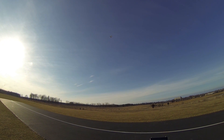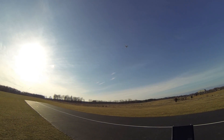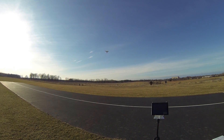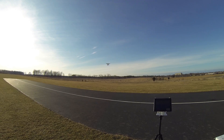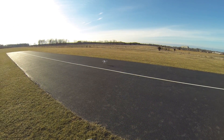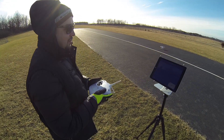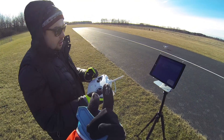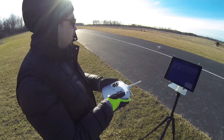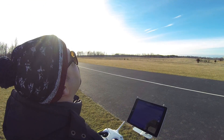I think it's supposed to come down a bit faster — if your battery is dying, that descent speed is a concern. At 30% battery you still have time to make a move. If you roll the throttle stick all the way down, that shuts off the motors — so be careful. I took over the control of the aircraft. But it's still in position hold — you can let it go at any second.